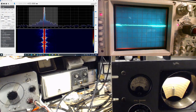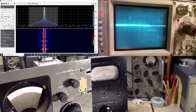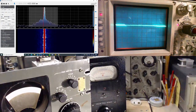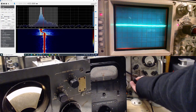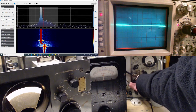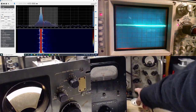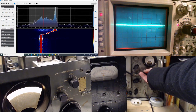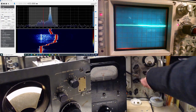That looks about 60. So to get 60 decibels above 1 microvolt, you need 100 times... oh, this is really low. Let's do this. We can go down here and go way up on this one, way up on this one. See if we can get back to the same 60 here. Okay, that's 60 on the meter. Well, now it's off scale up here. So it's basically 10 times 10, it's 100, or 100 times 1 to get there. It's so hard to read down around 100. Okay, that's 60 there. 100.